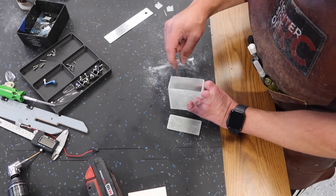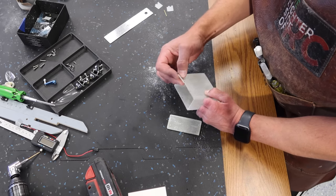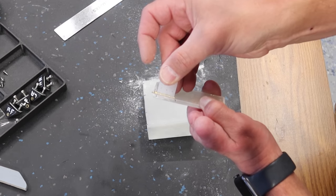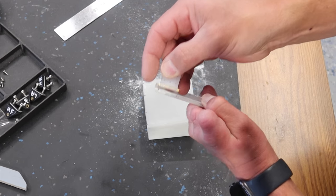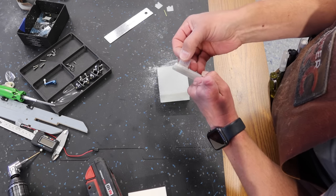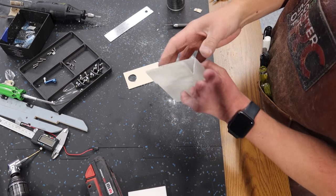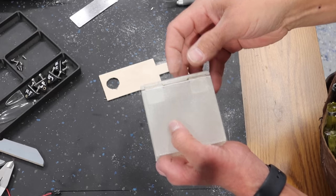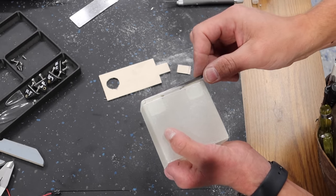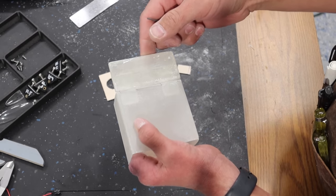A couple of important things here. Number one, we want to make sure that we clean up any excess material where hinges were sitting — there was a little bit of buildup in the corner. We took an exacto blade and cut that off. Marked out where the hinges are going, and also marked that out on the door. We need this hinge to sit as tightly towards the back surface as possible in order to get our geometry correct when this thing opens and closes. We've got our hinges done — the hinge interference is definitely a real thing, so you really have to focus on getting your angles right and your relief angles. We've got to do a little cutout for our hinges — all that stuff's important to make this work properly.